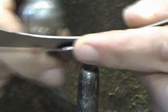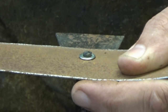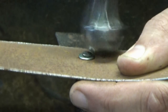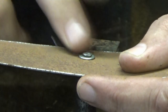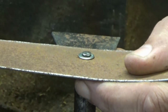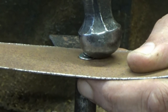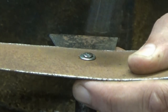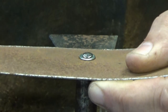You can see we're still very loose here and it isn't secured at all, so you just walk it around — a couple of hits in the middle, give yourself a bit more material as it mushrooms up, then walk it around again. Remember this might be on the inside of a helmet and you don't want to get cut across the forehead — your scalp bleeds really badly; make sure you're putting those edges down. Just keep working your way around, and every time you've gone around just give it a couple of hits on the top, then carry on around again. I'm using the edge of the hammer, not the full face — so we get a bit more of a scallop on the side.